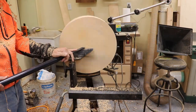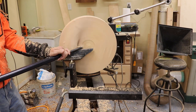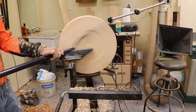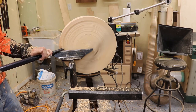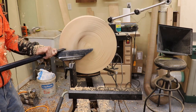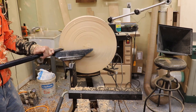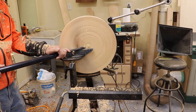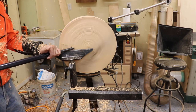Now I'm working on what will become the bottom of the platter. It was a pretty flat piece but a little bit wobbly still, so I made a couple of shearing cuts. You can see I'm riding the bevel here, but using most of the wing on the left side of that gouge just to kind of flatten out the surface and get a good starting point.